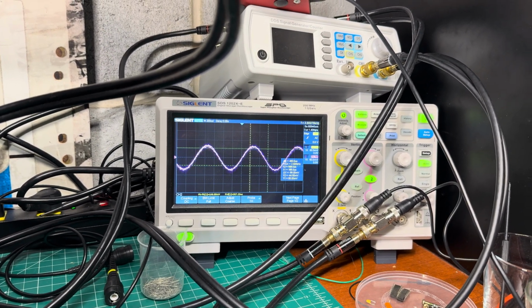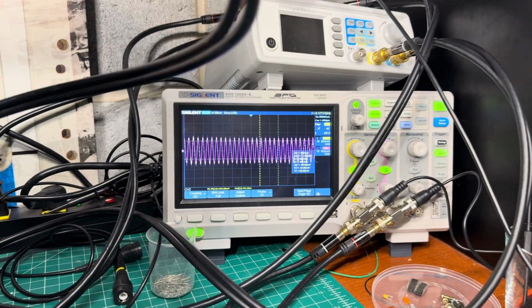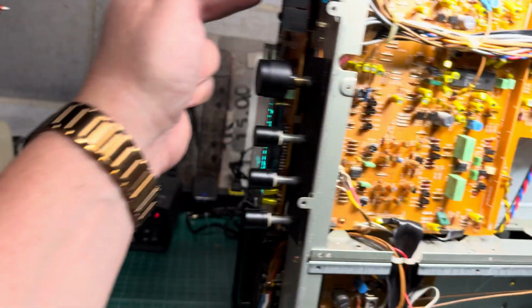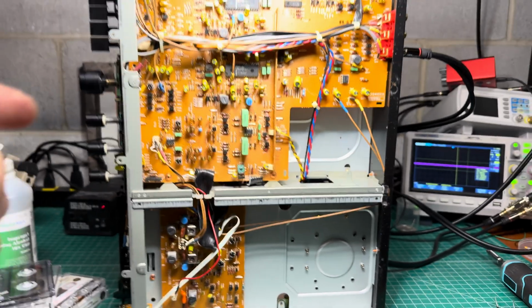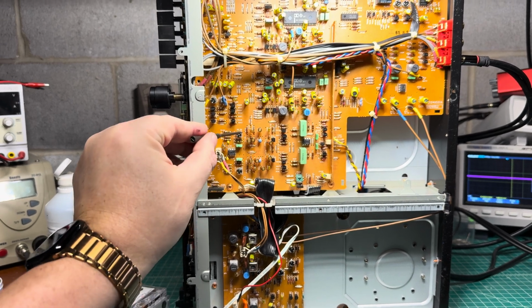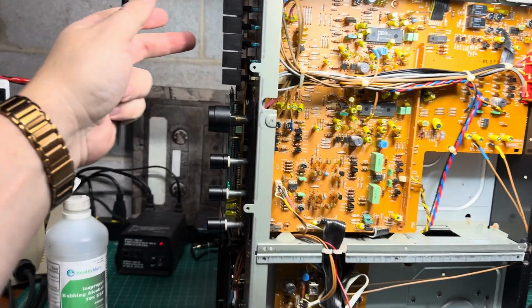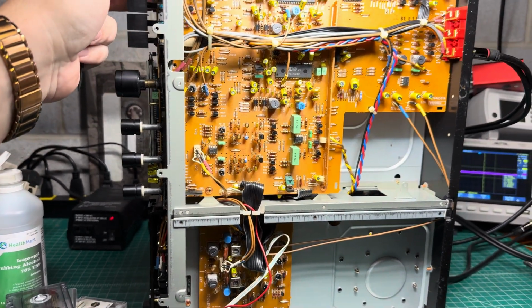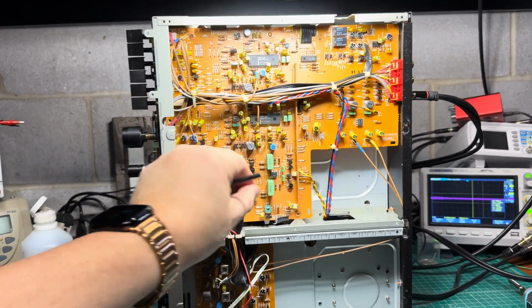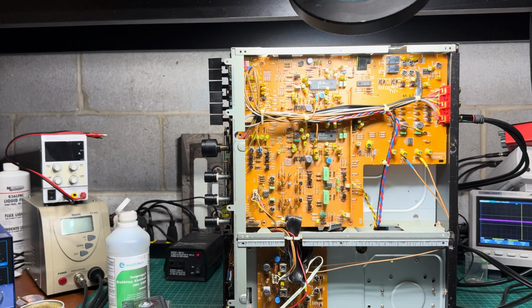The left channel is flat through the whole range, and the right channel has a drop of 1 decibel at 15 kilohertz, which is perfect. Alright, the tape just ended, I need to rewind. So we achieved a perfectly linear response, and I adjusted the playback response here to make sure we have a fully linear curve, which should correspond to the proper levels during playback. Now the deck should play all frequencies on both channels properly, because a minus 5 decibel drop was too much. I can understand 1, maximum 2 decibel drop, but 5 decibel is too much.